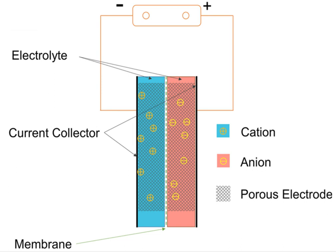In 2014, a RuO2 supercapacitor anchored on a graphene foam electrode delivered specific capacitance of 502.78 F per gram and areal capacitance of 1.11 F per square centimeter, leading to a specific energy of 39.28 Wh per kilogram and specific power of 128.01 kilowatts per kilogram over 8,000 cycles with constant performance.